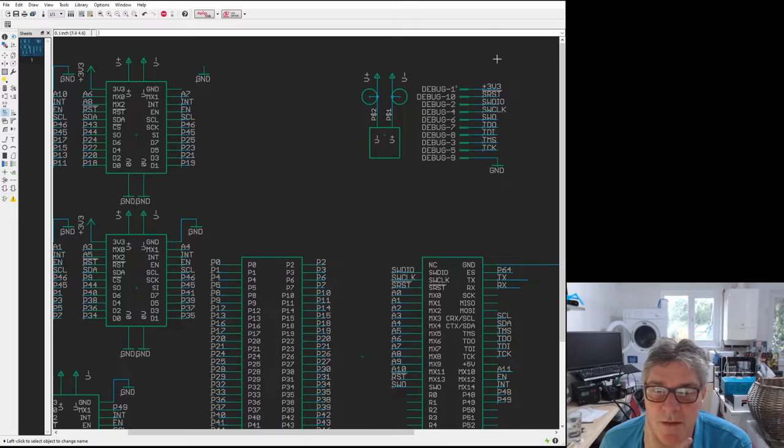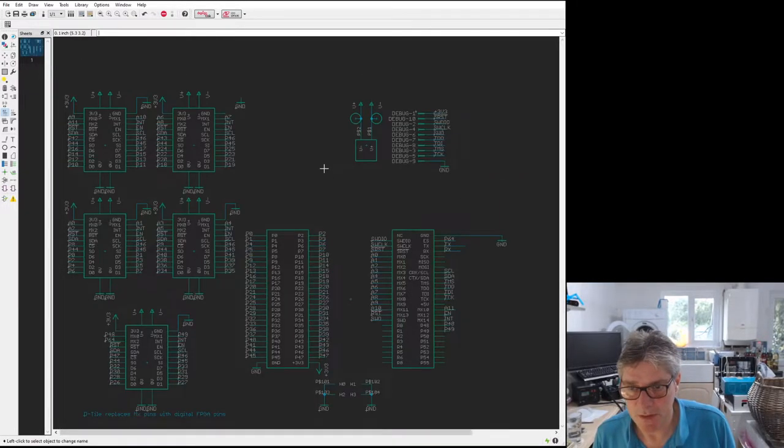And in fact, you see here at the top, I've got a 10 pin debug connector, which wires out externally for the JTAG pins as well as the SWD pins. And it separates them rather than overlaps them. Might need to come back and talk about that, because that needs tackling as an issue, or at least understanding. But I wanted to wire them out on this board as well, so that we can use them.